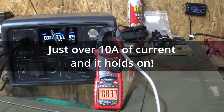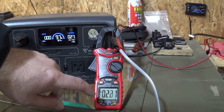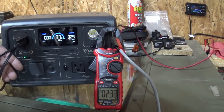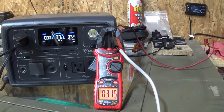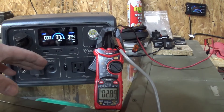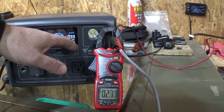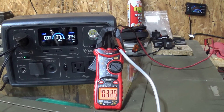That's about the max — we're just over 10 amps of pull coming through this and the breaker didn't trip; there's no heat coming out, feels fine. Now we're going to come down about two and a half amps and then again it's going to drop down after the heater really gets into its run cycle. We're already pulling less power than we were when running on the AC side, and this is going to drop down to about 20 watts when it gets into its regular run cycle.